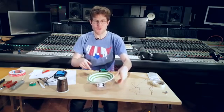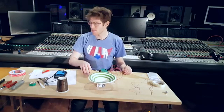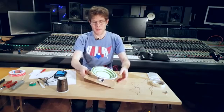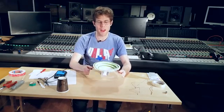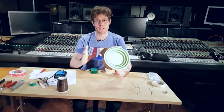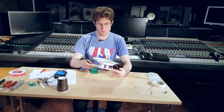So using everyday things that you can have lying around the home, and some magnets and just some extra tools, you can actually make a speaker. It's maybe not the most bassy speaker that you've ever heard in your life, but actually the bass response in a lot of speakers is because of the actual box. The construction creates a resonance and that amplifies the bass.